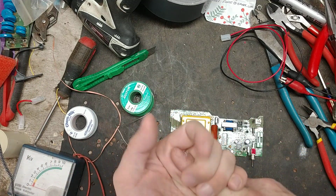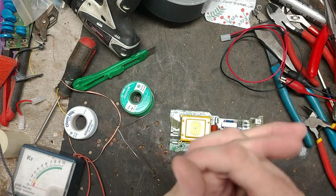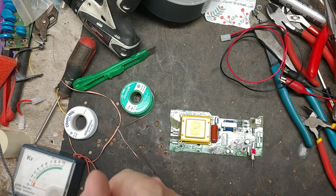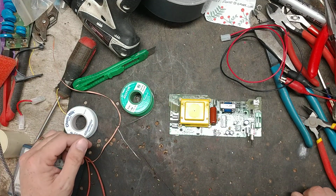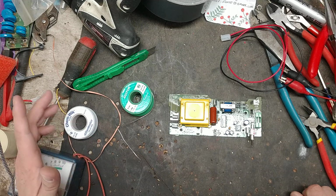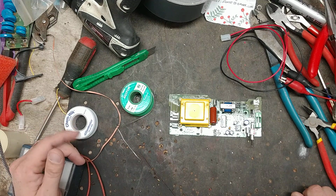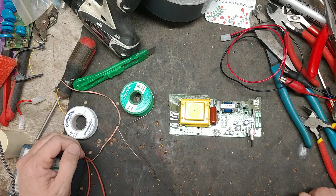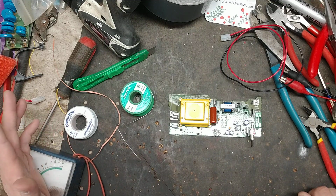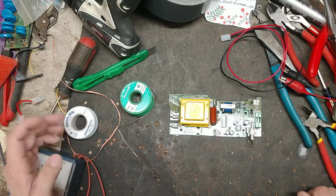If they don't come on at all, no flashing or clicking, then check your battery. Make sure it's over 6 volts. It's a 6-volt battery. It should be like 6.2 to 6.6 volts to make it run right. Most of those 6-volt batteries inside those S17s usually read about 6.3 to 6.5 on average. I've seen them read 6.7, but that's on the higher end of what it will charge up to. But if it's like 5.9, 5.8, 6.1, 6 volts, it's not going to run right. It's going to flash once and then stop, typically. So that's usually a sign of a low battery. Then you need to check your battery.